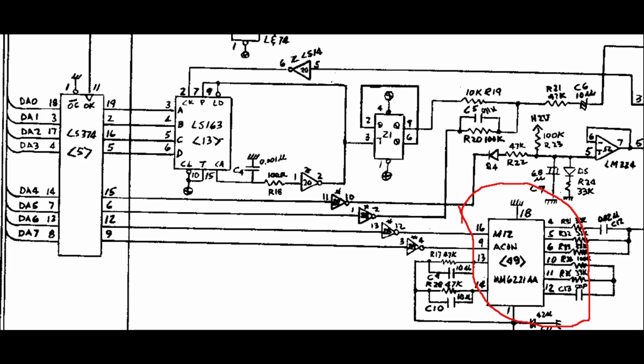However, in the only occasion I could kill the mothership, I heard again the Romance d'Amour. Now, both the wrong sounding effects are enabled using this 74LS374, which is the last original one in this CPU PCB. In fact, 2 out of 3 were already faulty, so I believe that even this one is bad, even if I didn't find any floating output like it was found on the other ones.